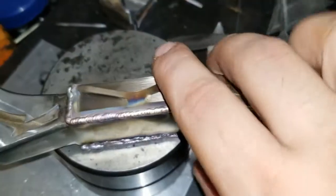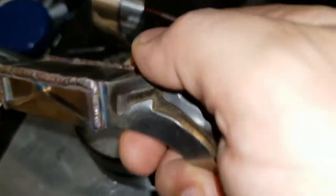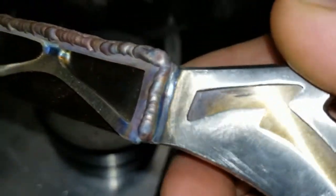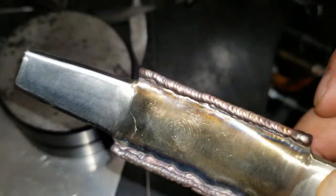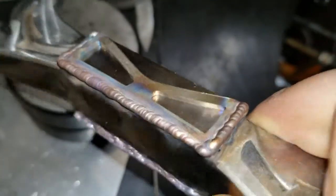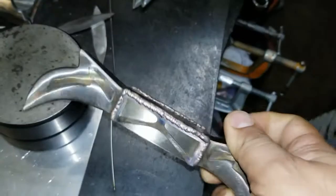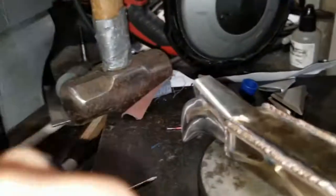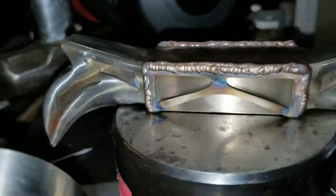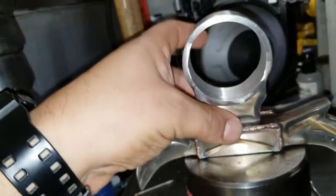And just to show you, I welded those two details on top of that center piece for my sword. And you guys can see I had to add extra material, so when I blend I can get my sharp, nice, crisp corners, very well defined. And the only way to do it is you need to add extra material to contribute to the strength of the weld. And you can see, like I said, a lot of that stuff is already pre-finished, pre-advanced. I'm kind of just putting it together right now, giving a little eyeball on the project.